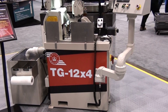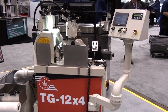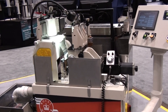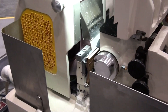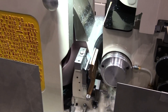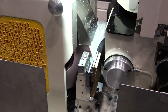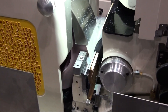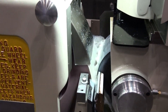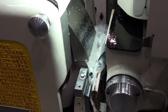The basic through-feed machine is cost effective to purchase, capable of fast setup and simplified changeover. The machine can grind a wide variety of materials with the change of a grinding wheel. Super abrasive wheels like CBN or diamond wheels are used for carbide, ceramic, or other hard materials. Close tolerance work is accomplished in either high volume or low quantity jobs.